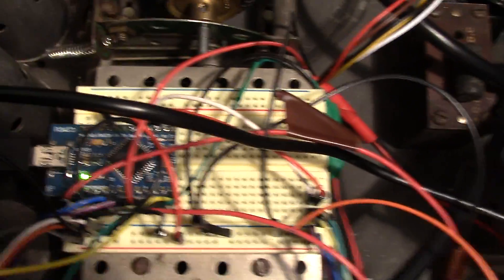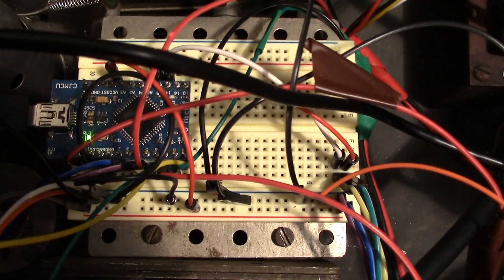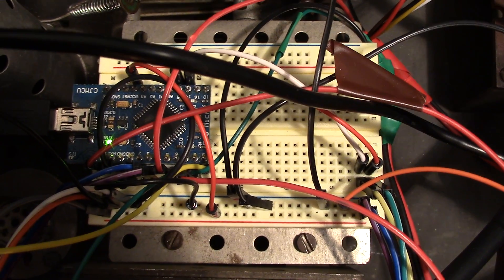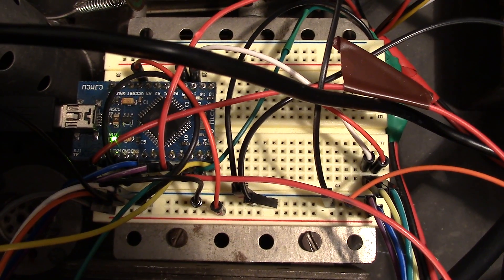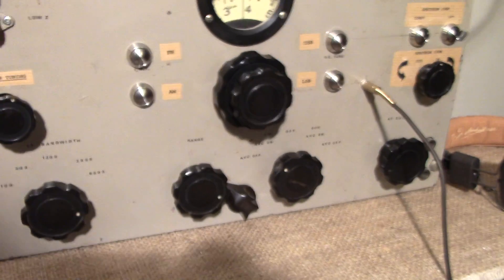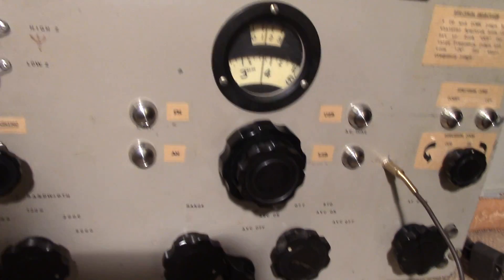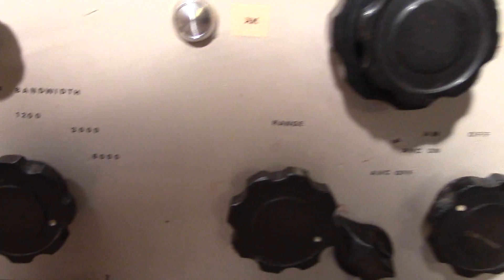You can spot here we're using an Arduino as our microcontroller hardware platform to pick up the signals from the rotary shaft encoder and the other buttons and controls needed to allow us to explore the radio spectrum. This little RSP can go anywhere from 10kHz up to 2GHz, whereas the original Marconi CR100 would only go from 60kHz to 30MHz.